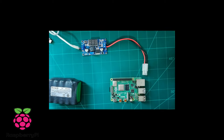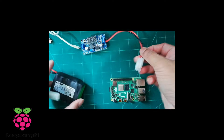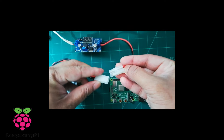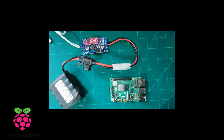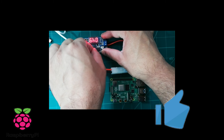The LED indicator on the buck converter will show only the voltage but not the current. For current measurement you need to use a multimeter to confirm that it has got 3 amps current supply. As you can see I got a voltage of 4.9 volt, but I need 5 volt, so I am adjusting it with the knob.